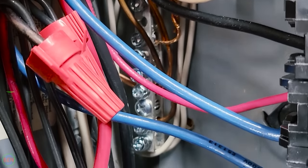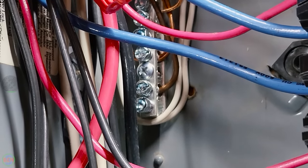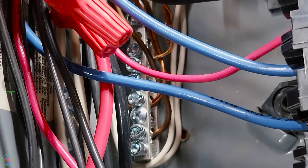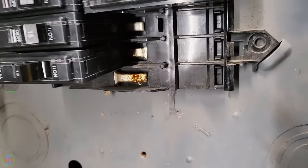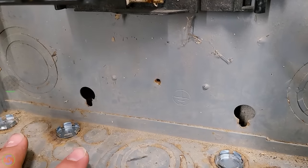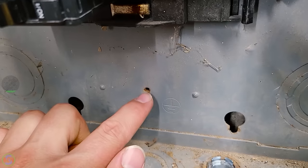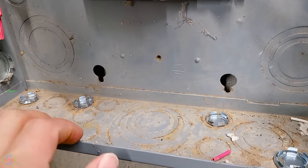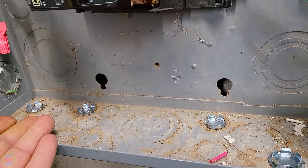You can see all of the grounding conductors from the different circuits are landing on it, and it's attached into the back of the panel using a couple of small screws in the pre-drilled holes for that exact purpose. Depending on where you put it, there's different nubs, sometimes I like to call them. Like down here, you can see there's a spot. In my main panel, I actually put my ground bar at the very bottom right here, and it lines up with these nubs, and then you use that pre-sized hole right there to connect it. So I'll link to ground bars in the description, but you need to get the one that is compatible with the manufacturer of the panel that you're using.